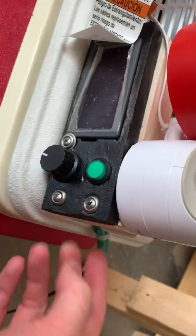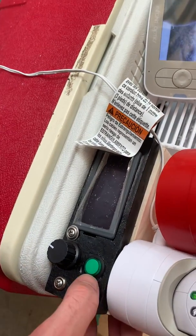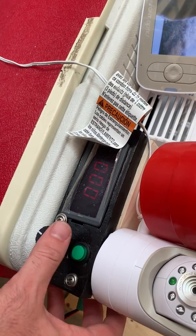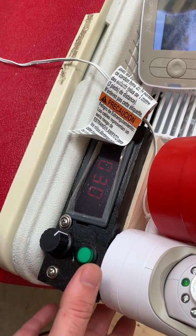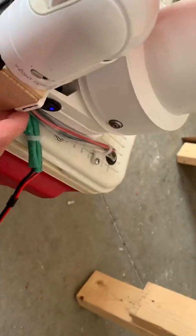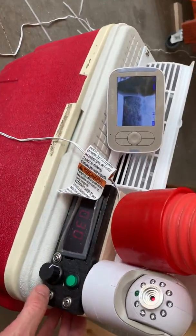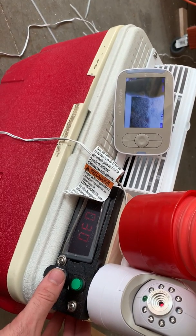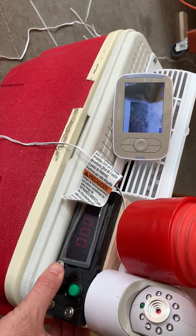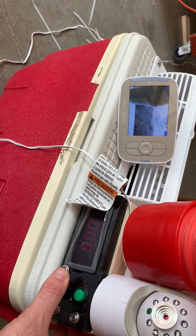I kept the housing and just used that to make a little temporary wooden box, but I think I might make something out of plastic for that. It's got a fuse built in-line for 10 amps. It draws about 6 amps total when the blower motor is at 100%, and when the blower motor is off, it's a 2.5-amp draw for just that little bilge pump.